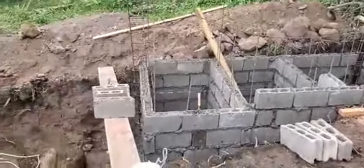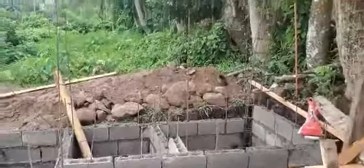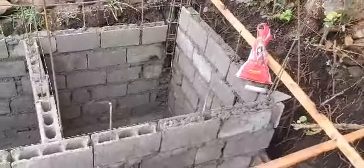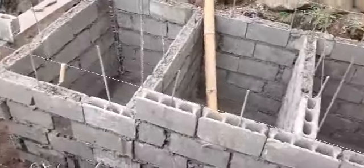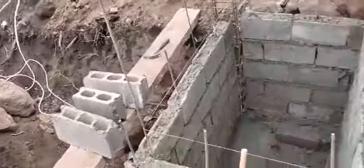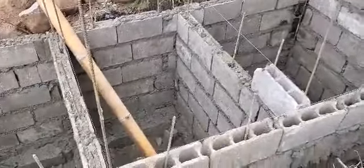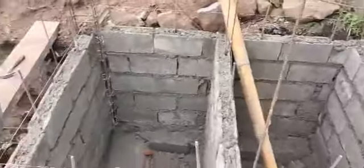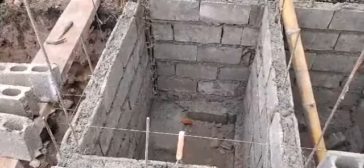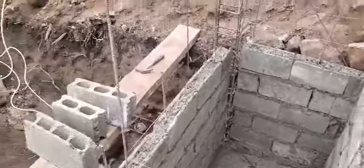The big highlight today is the septic tank — they made really good progress here in basically a day and a half. Here is the septic system: chamber one, chamber two, chamber three. I gave them the idea of separating it so the two toilets go into the first chamber, and overflow if needed goes to the second, so we should never have to clean that out. Then the three sinks — actually four with the dirty kitchen — plus the two showers, all dump into this third chamber.